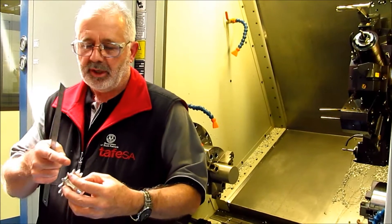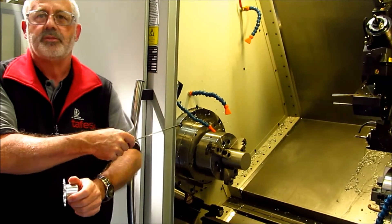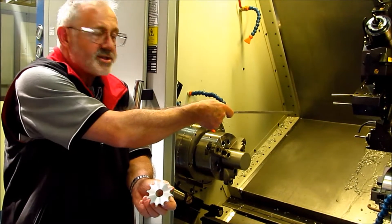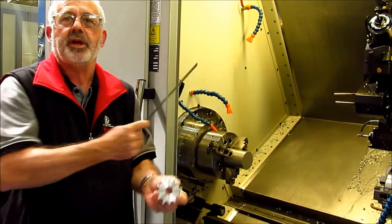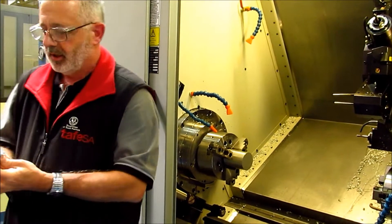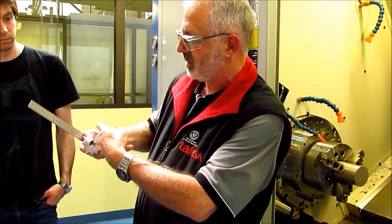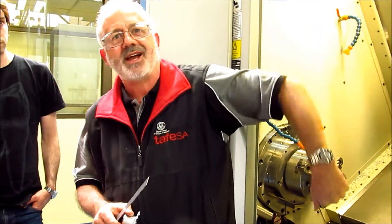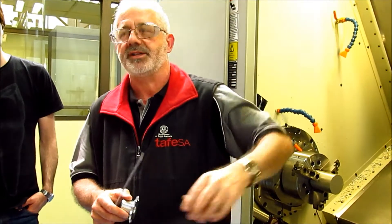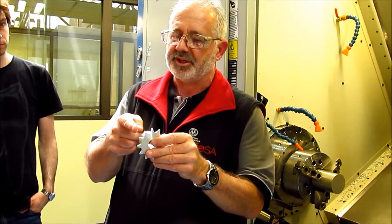When we get to the tooth form, on a mill we'd be contouring. On this machine, the spindles can be used for milling purposes as well, so the machine can be put into milling mode to accommodate these tools. The spindle can be locked if I want, or it can be put into rotary table mode where it'll be turning at a certain angle. In that case the part sits like so, the tool comes in, and it goes plunging in and out at different diameters as the angle changes. You'll see X and C axis code — C is the rotary axis here — and you'll see thousands of lines of code going past very fast. It also speeds the feed rate up and slows it down depending on the diameter, because the larger the surface the longer the distance, and the smaller it gets the shorter the distance, so I change the feed to accommodate that and maintain our surface finish.